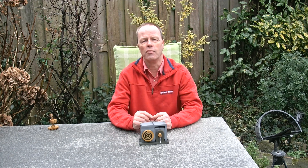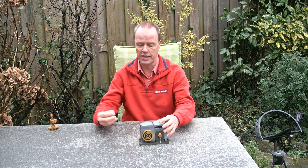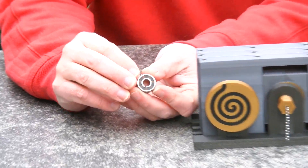most of them work based on friction. For instance, a belt with conical plates that move the belt out or in, or with balls — the one in bicycles where you tilt the ball and that way achieve a continuous variable transmission. But all of those use friction and this one doesn't. And what you see here is a one-way bearing.